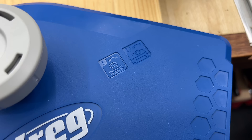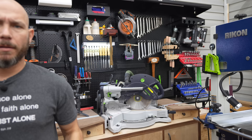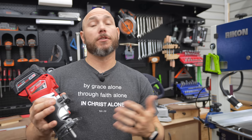There are instructions on the top that show which way the router should go depending on whether you're using a hand router or a router table. To use this with a palm, trim, or regular router, you want the bearing closest to the router riding along the edge of the corner radius template. On the router table, you'd use the bearing on the other end.